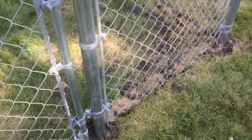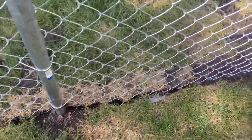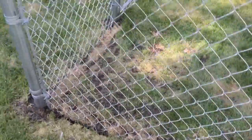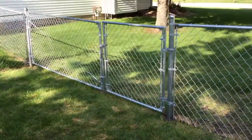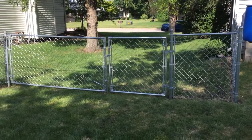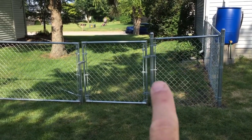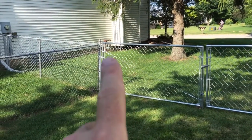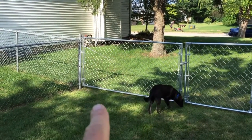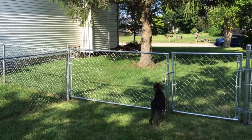That's pretty much the gate and fence project. I've got a little bit of fill to do — I put some of the grass back where I cut it out. I'm completely done and really happy with it. I'm glad it's over because once I got to the fence portion it was a bit of a pain, because I didn't account for the fact that where I attach to the neighbor's fence on both sides, those poles are out of square, which really wreaked havoc with getting the gate to line up. Hope you enjoyed watching this!